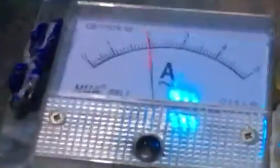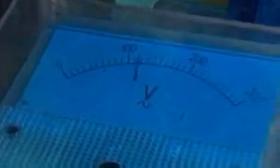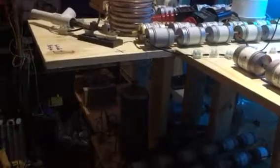And those capacitors are a lot smaller too. I think they're in the PFs. So, get that swapped out and verify how it works. It still draws just the same, right? 2 amps, 120 volts. And an occasional breakover. When you get those good discharges like that, that's when the GDT really lights up. And the wood.